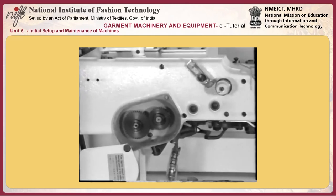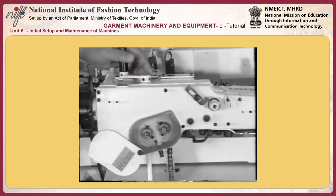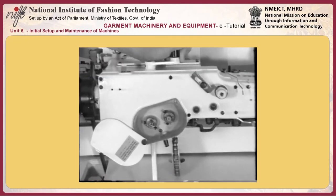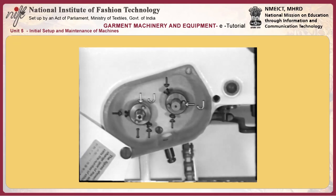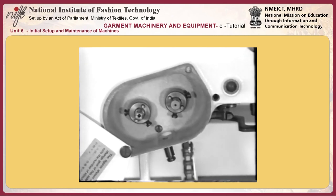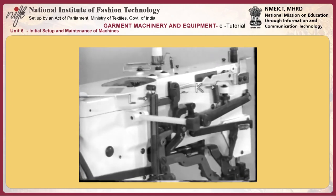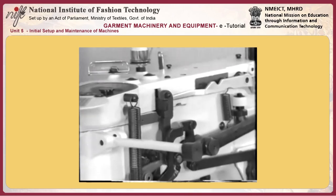How to adjust: Tension release timing for both tension disc number 1 and 2 is adjusted by changing the position of the cam mount on the main cam. Adjust the tension release timing for first bar tacking section using tension release cam number 1 (i). Adjust the tension release timing for the start of sewing using tension release cam number 2 (j). Shift them in the direction of the arrow to advance the timing to release the tension.